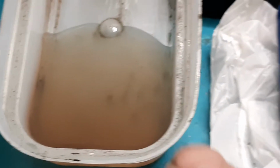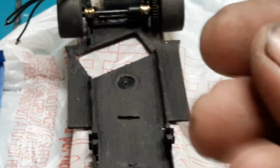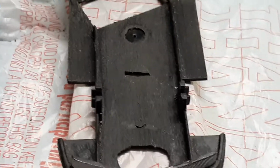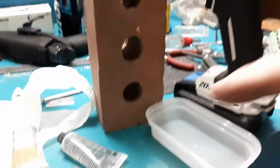The idea is I'm going to mix up some of this fiberglass resin. I don't know how much, probably about 5 drops worth of that stuff in there. I'm going to apply some onto the ABS plastic. I will apply some to the textured surface. You should probably wear gloves. This stuff is nasty. Depending on how hot you mix it, it can be fairly slow drying. And you can use regular epoxy if you want to. And then we have to hurry up and wait.